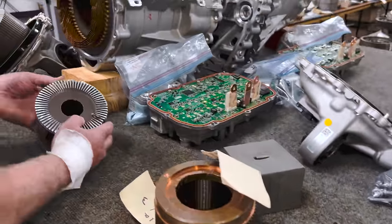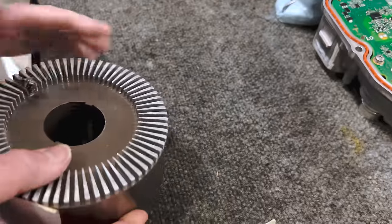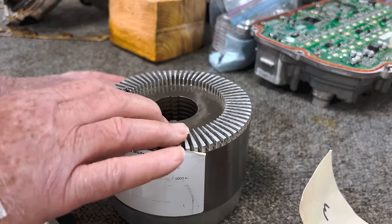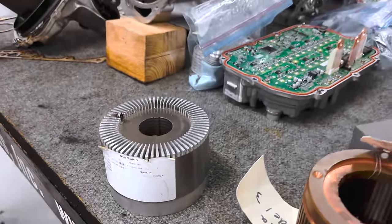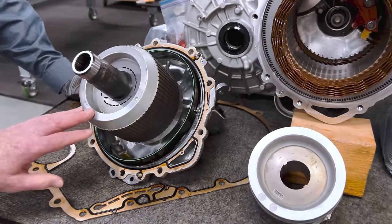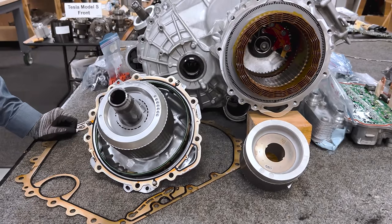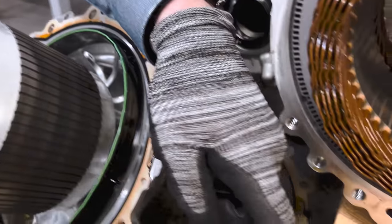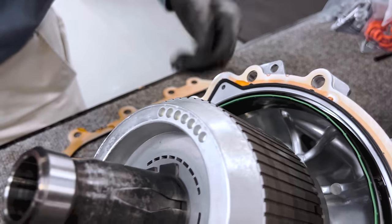What they did next was go to this new induction motor. You can see they put their laminations in and then cast over the top of it. Basically the laminations are pushed in, then it's brought to a molding machine and aluminum is injected — that's kind of what's going on here. You can see that motor and this motor are similar but not the same; this one is quite a bit bigger in diameter. Also, previously they had a smooth outside diameter, but now they've put these little grooves in, which helps reduce motor noise.